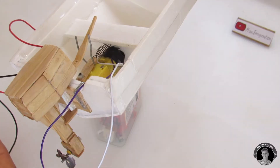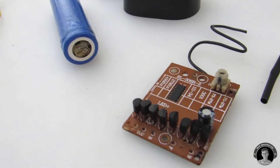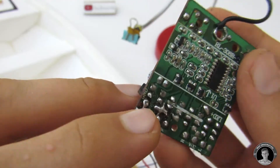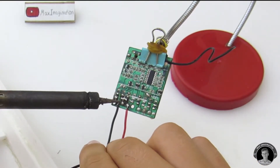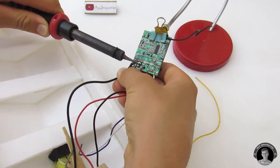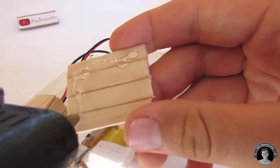Here are the things you're going to need to make this boat remote controlled — I'm using a toy-grade RC transmitter and receiver. At the back of the receiver you'll notice there are soldering points for the motors and a 3.7V in and ground. Solder the two wires coming from the outboard motor to where it says backwards and forwards on the receiver, and then solder the turning geared motor wires to where it says R and L (right and left). Also be sure to solder on a couple of wires for the battery where it says VCC and GND. In case anything blows or heats up too much, be sure to glue on a layer of popsicle sticks to the bottom of the receiver before gluing the receiver into the boat.